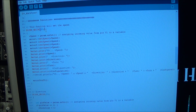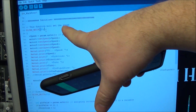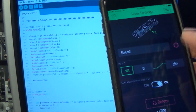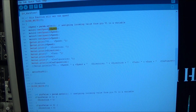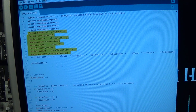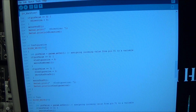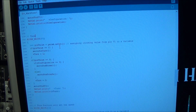Blynk handles the rest; all the other code is subroutines. Here's a function for Blynk virtual pin 0 — V0 is for speed. The speed slider writes a number between 0 and 255 to V0; right here is where we read it and set it to v_speed, then set that speed to the motors and do some serial prints for debugging. V1 is for direction, V2 is for the wheel configuration — which way they're pointed — and then if we turn we do that.